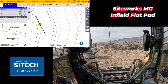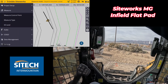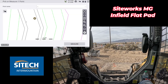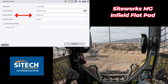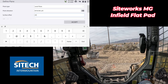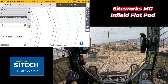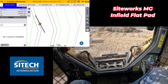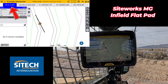Now that I've actually got a point — if I zoom in on there I can back off it; it doesn't really matter if I'm still sitting there. Now what I can do is go in here, go to my menu and measure. That icon on the left side is going to come up again — my flat plane, level plane. I'm going to go to my elevation, hit the menu, and tap that right there. So there's my 5018.594. For the surface offset, I want to be about 0.65 above that. I could save it as a design, but I'm not going to. I'll hit accept, and now you can see I've got a fill of 0.74. If I go ahead and set back up here by this pin at about the same elevation, there you go — I've got a fill of 0.65. So we're good to go.